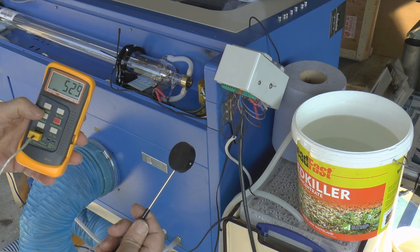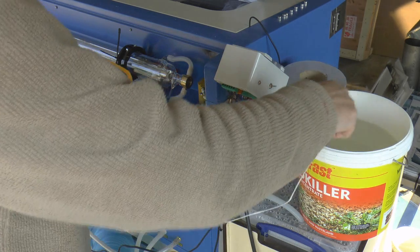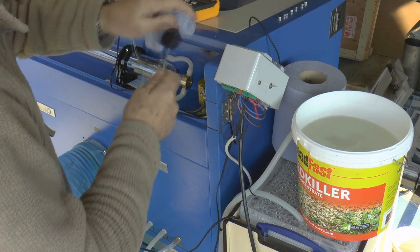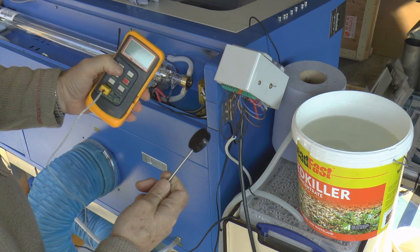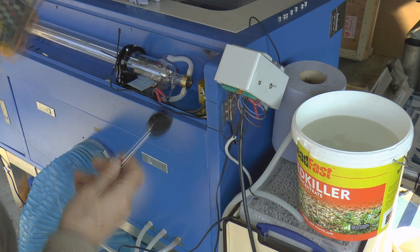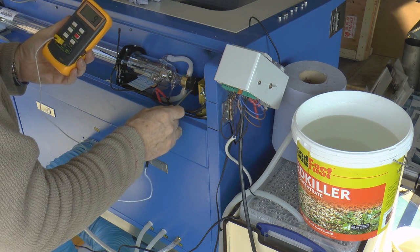Okay, so look, I've just done a test, and what you must do, after you've done a test and made note of your reading, is turn the meter off. Stir it round in the pot for about 15 seconds, that's all it will need. And a quick wipe off, because it's a nice shape to wipe off easily. And then we need to turn the meter on, because turning the meter on will reset, and it's 9 degrees C. We'll press the max button now, which I've made red because it's easy, 9.1, and we'll run a test. So we've got to remember one number only, which is 9.1 degrees.